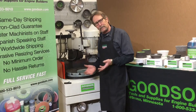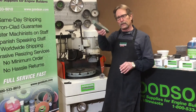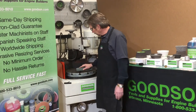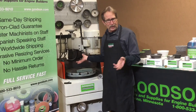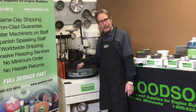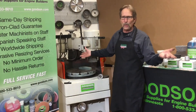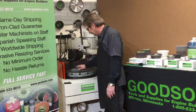I want to talk about basic maintenance with regards to the table and the tooling. We offer this abrasive material called our Burr Buster — card number BB-9 from Goodson. We soak it in some solvent to give it a little more aggression for cutting. As you're lifting and muscling around these heavy flywheels — especially diesel truck and agricultural flywheels — you'll probably drop one and put a ding in the table. Anytime a dent goes down, metal has to come up, so we want to deburr that. Run this over the table periodically — at least once a week or twice a month — to make sure the whole tabletop is nicely deburred all the way through.